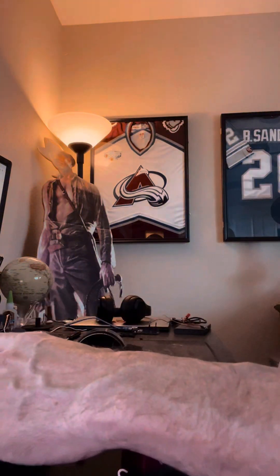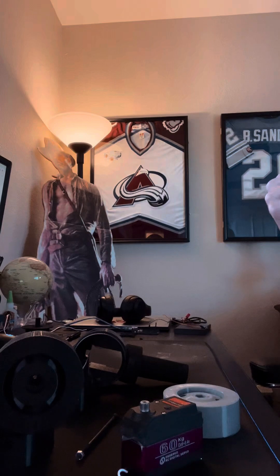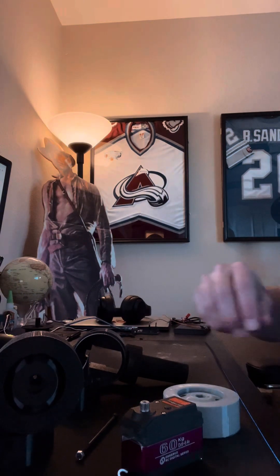This is attempt number four at the shoulder joint. Last time I was playing around with a cycloidal gearbox to get this thing to work — it didn't work out too well. The gears were all made of plastic, the shaft for the gearbox was made out of plastic, so it presented too many problems. I'm not a machinist, so I wasn't able to make that work right. The amount of force it takes to move one of these shoulders is just too great for that.